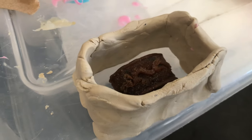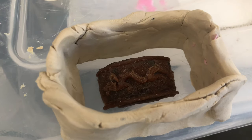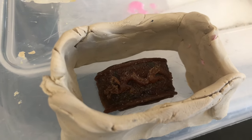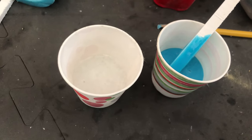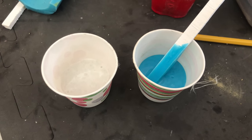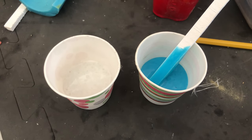There is the clay wall around my part. I'm going to pour some mold material in there and make sure I get all the air bubbles out. There's my equal parts — part A and part B. I'm going to mix this up really quickly, make sure I pour from a high level and pop those bubbles on the way in, and pour it over my mold.